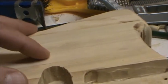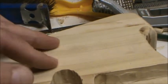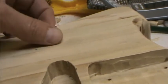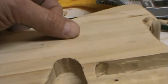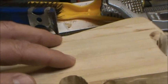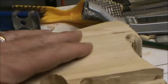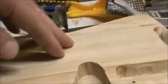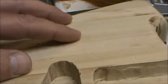When you're using clamps to hold down the guitar body, even the ones with the rubber or plastic ends on them will bite down too hard. I don't know if you can actually see this divot, or if you can just see a color differentiation. But this was one of those clamps with a rubber end on it. So what I should have done was taken a scrap piece of wood at least this long to disperse the pressure, because I'm sure I will be able to get it out, but it's going to take a lot of work,